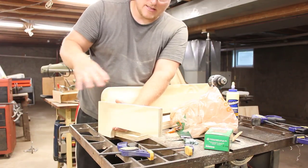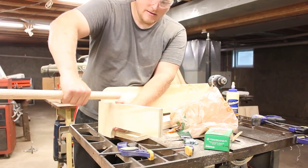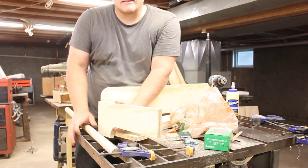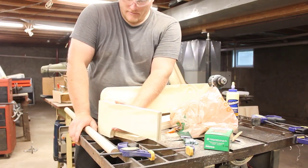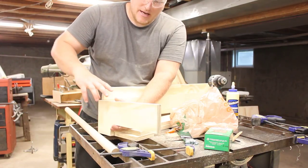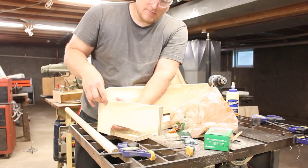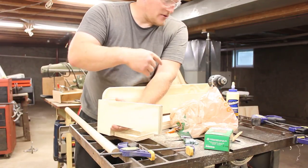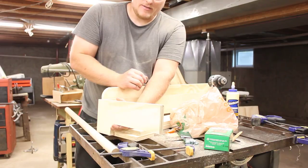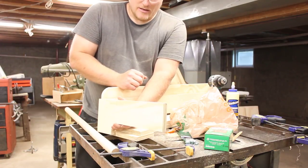And then to locate and lock everything in place structurally, I have a dowel which I'm going to slice into little bits that would stick in two places, and that will give it a lot of racking strength. I made these kind of long, which is inspiration from Matthias Wandel — that one workbench video he did, because he wanted racking strength with his legs and made extensions on the legs to get wider spacing for attachment points. Another reason is I can make the rails not 75 inches — which is what the mattress is — but something more like 66 to 68 inches, which will fit in the car a lot better.